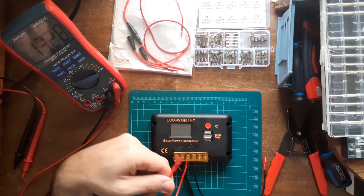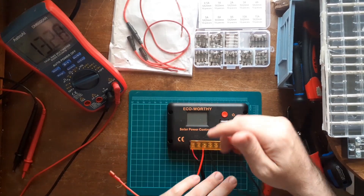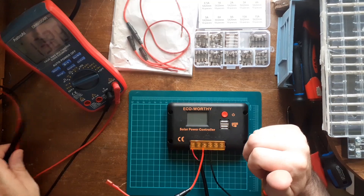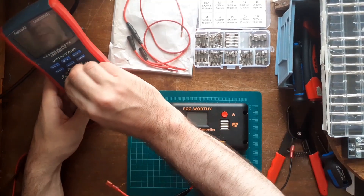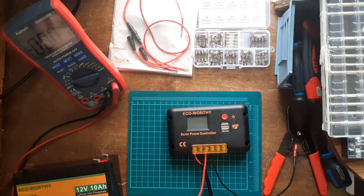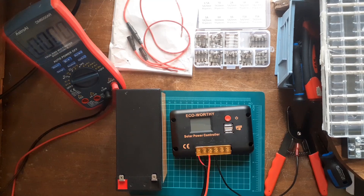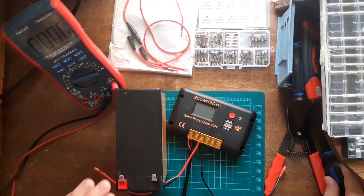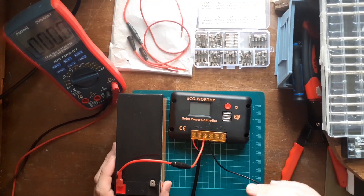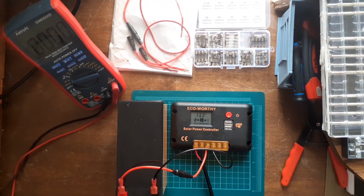The battery positive is fused — I highly recommend always having a fuse on the line. The negative goes to the battery. I'm not going to use the auxiliary output; my projects mostly use USB, and it's great that this unit has two USB chargers. Now let's bring the battery back and reconnect it. Pay close attention to polarity — you do not want a lithium fire, they become dangerous very quickly. Take the positive, double-check it, connect it, then take the negative and connect it. Finally, connect the solar panel adapter clips.